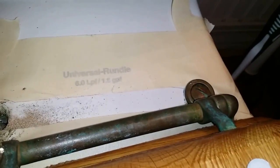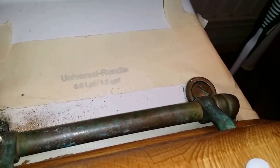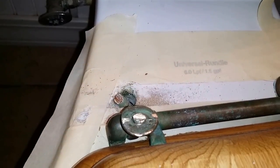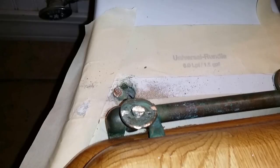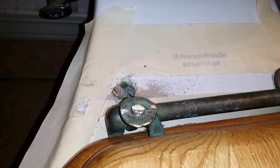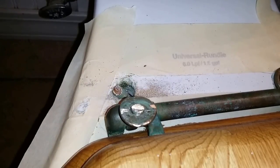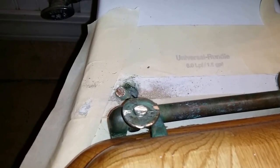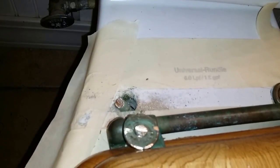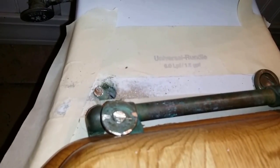So I'm just going to repeat the same on this side over here and that's about it. Unfortunately, once they weld in place you just have to cut them to get them loose — and that's when you're really thankful they use brass instead of iron. Alternatively you could use a reciprocating saw to do the same work, but the problem is you'd have all kinds of scratching all the way through both sides and a lot of mess. I know because I've done it on the bottom of the toilet and found out later you could not clean it off.